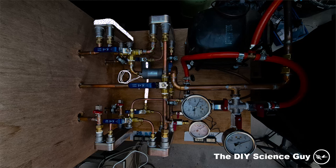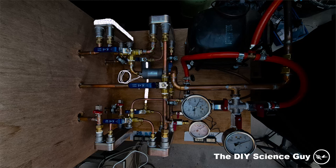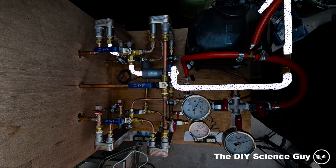When it absorbs heat it expands without rising in temperature, but at some point most of the liquid has turned into gas which is then still very cold and will start to rise in temperature. The amount the temperature rises is called superheat, and with it you can determine if the right amount of refrigerant is present in the system. The superheat is the difference between the vapor temperature and the temperature of the gas when it exits the evaporator. If that difference is too low there is too much refrigerant — condensed refrigerant can enter the compressor and damage it since it can't pump liquid. If it's too high there is too little refrigerant, efficiency suffers but the system is not harmed.